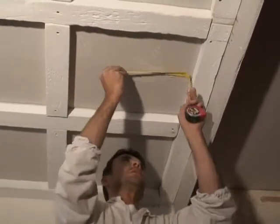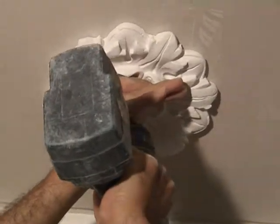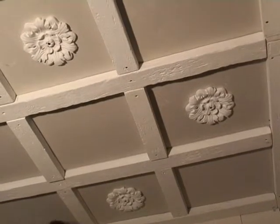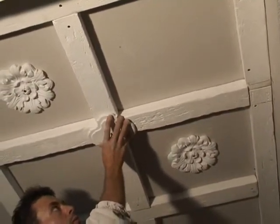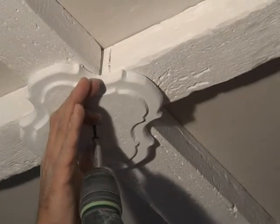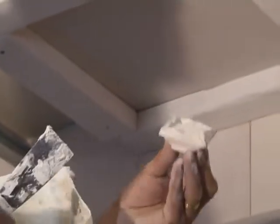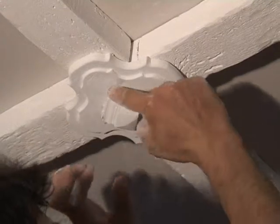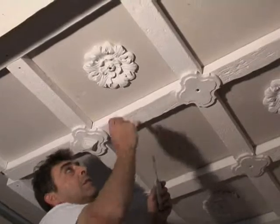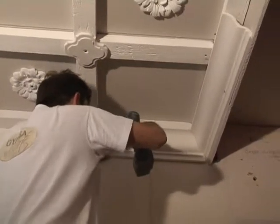Measure the center of the square coffer and drill a hole in the middle of the decorative rose as well as the stud that covers the screw. Prepare the embrasure where the screw will go and screw in the rose decorations in the center of the coffers. You may apply the rose decoration in every coffer or alternate between the empty spaces. Position the covering stud at the cross-section of the beams, taking care to cover the screw heads. Prepare the decorative diamonds with a bit of spackle on the edges and position them in the center of the cross-section studs. With spackle still in hand, cover the screw heads of the rose decorations and any joints of the beams. You may apply a cornice around the perimeter of the room under the decorative ceiling. The ceiling is now ready to be painted.